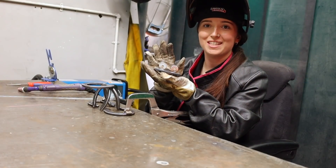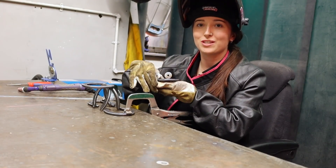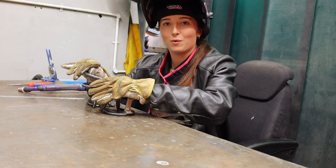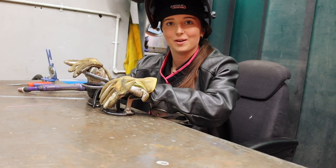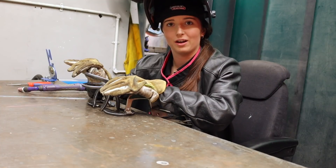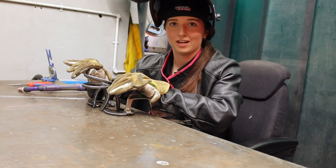The last part to add to the frog sculpture is the horseshoe with the eyes. You just add this to the bottom of the mouth. You can have it as wide or as small as you like, and I hold it with one hand and tack it together with the other. I just fuse the steel together with the TIG torch first so I can move it if needs be, then I go ahead and add filler rod to it.